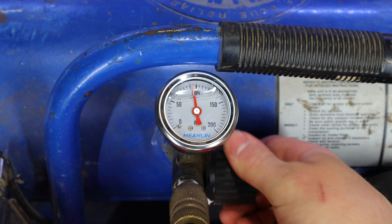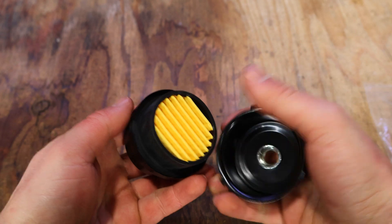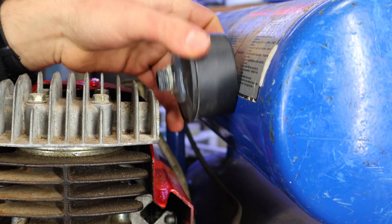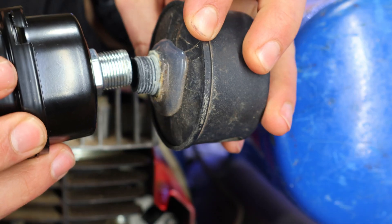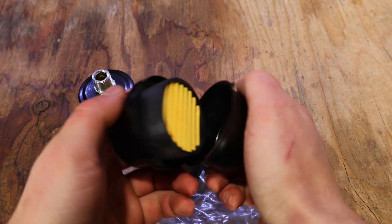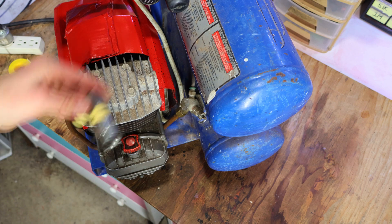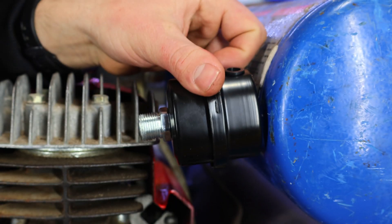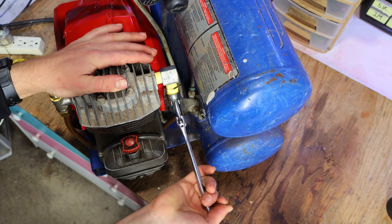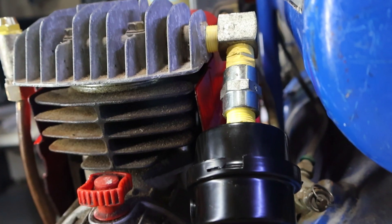I can also adjust the pressure regulator and watch the needle move fast and smoothly. To make sure the compressor lasts as long as it can, I ordered a new air intake filter for a few bucks. I did this because the original filter was entirely made out of plastic and seems to have been repaired with hot glue, while the new one is made out of steel, comes with another filter housing and two extra replacement media. All this will allow me to forget about buying new media for the next few years, since these filters only have to be replaced once a year. I ended up having to put together some plumbing because the filter does not fit directly. Just like that, the filter can easily be threaded in place, and it is now actually easier to access, which will give me a bigger chance of replacing it on time.